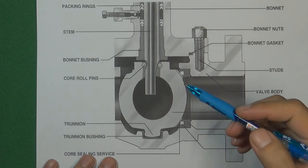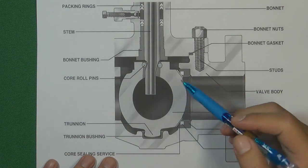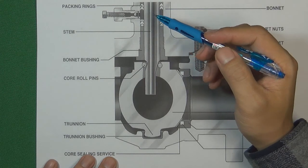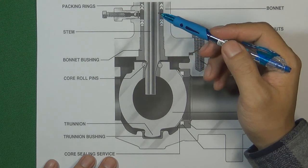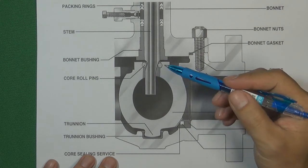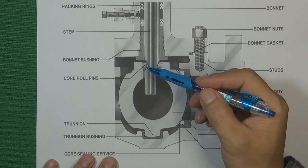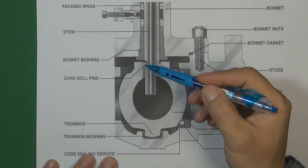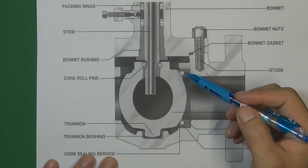This illustration explains how, when we open an orbit ball valve, the ball will leave the valve seat first and then turn. As we discussed before, the orbit ball valve stem has an orbit slot controlled by a pin, so the stem movement has two steps: first move up, then turn. How do these two steps make the ball leave the valve seat first and then turn? According to this illustration, on the top of the valve stem there is a tilt area. When the first step of the valve stem movement occurs — the stem moves up — it pushes the ball, and the ball swings to one side, which makes the ball leave the valve seat.